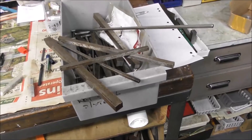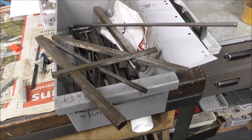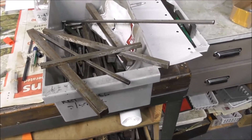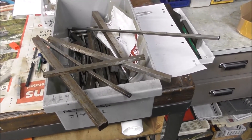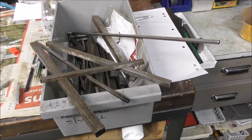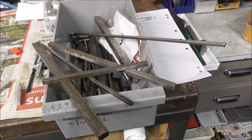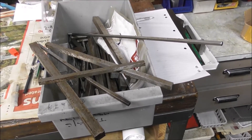If you're wondering how you can source material for stops in your vice, key steel is a good option. You can buy lengths of it in all different sections, reasonably priced and commonly available. Hacksaw it off to the length you want and just finish-machine the end to get it nice and square.